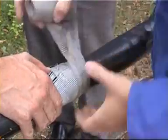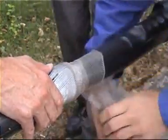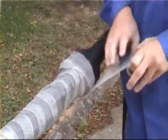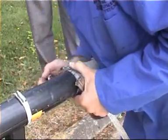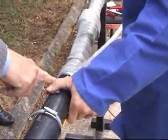Apply the heavy duty copper mesh from armour to armour across the joint cap with 50% overlap. Secure temporarily. Connect the three main earth straps over the joint cap and secure with the armour clamps provided.